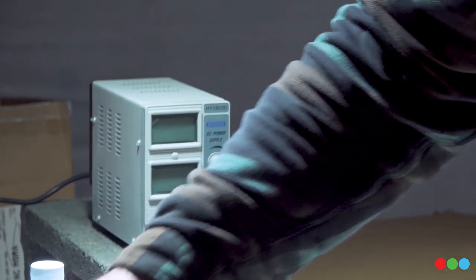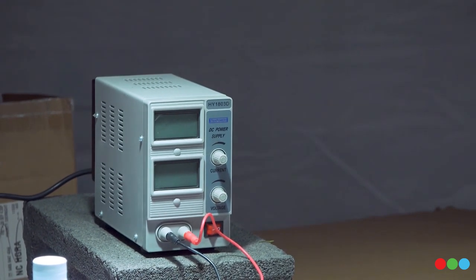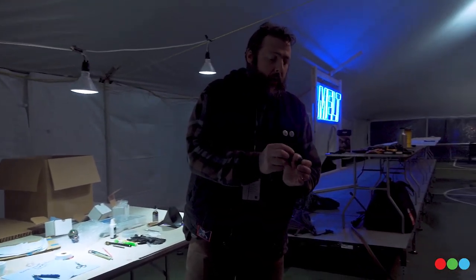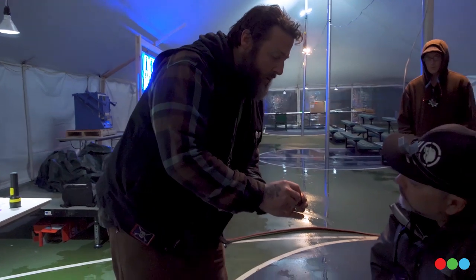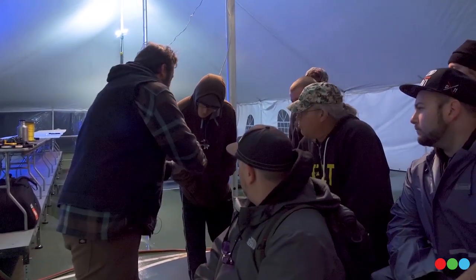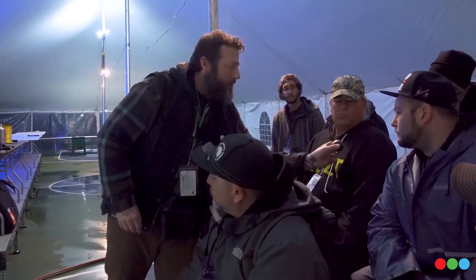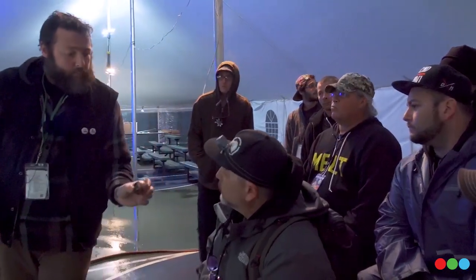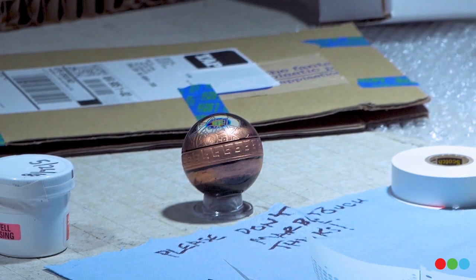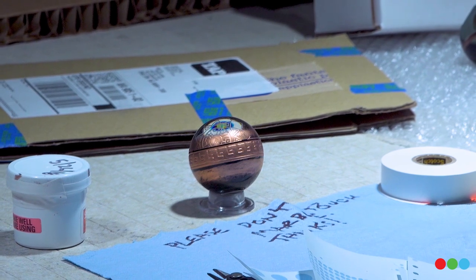So with this piece, I have painted the whole sandblasted band. There was some overpaint, but then I took a razor knife, my X-Acto knife, and I scraped away the paint where I didn't want it to go past to trim out that band. So the circuit is sort of broken, right? And what that's going to do is ensure that the copper accumulates on that band, but not any of the extra.